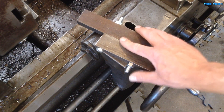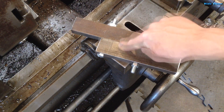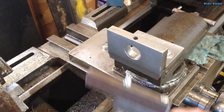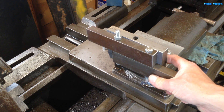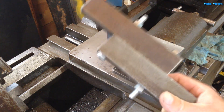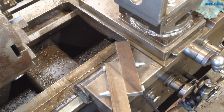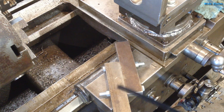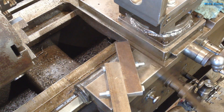I have the two bolts put in it and I have to say that is just nice and flush. So the next step is to set this thing up here and put an inch-and-a-half hole in there. I'm trying to make another decision here — I want to put a spacer in there to bring it out, because if I just have these bolted together and make an inch-and-a-half hole in there it won't clamp down on that shaft.